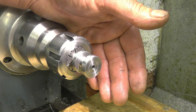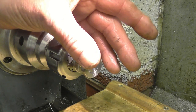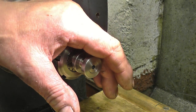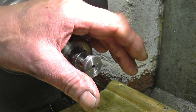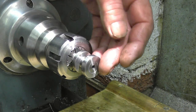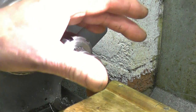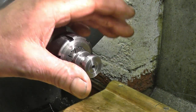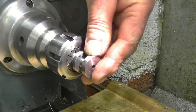So what we need now is this dividing up into 10 equally spaced divisions. It's a 1mm thread so one full turn is going to move the tool 1mm. A tenth of a turn is going to move the tool 0.1mm. Honestly I think 0.1mm is enough to line up by eye on the divisions that I'm going to put on here; any more than that and I'll put a clock gauge on and use it to adjust the tool. So I'm going to split this up into 10.